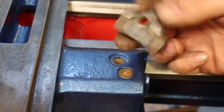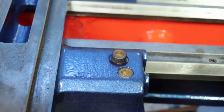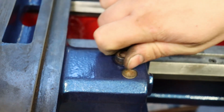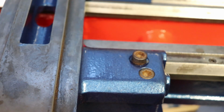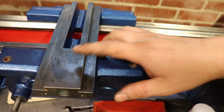So with your carriage lock, it fits down the back, underneath, and if you get the feel right, there, it literally just sits loose, your carriage moves, even with a little nip. And you slack it off and it just glides along on that front edge. So, one carriage lock.